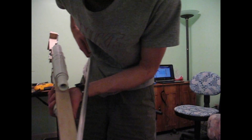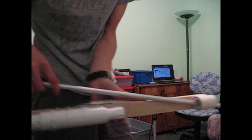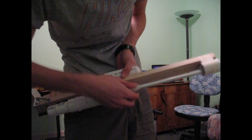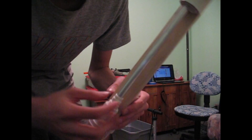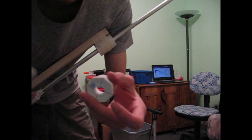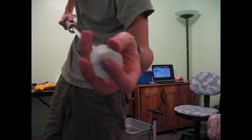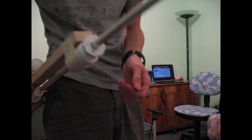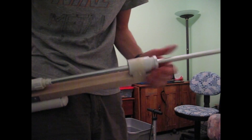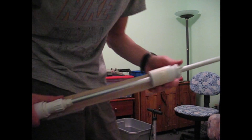I'm going to have an adapter of some sort — this is a one-inch female. The idea of having a large opening here is you can stick a barrel in diagonally, pull it all the way, and then screw it into this adapter. The reason I want this is so that I can have different size barrels, either smaller or larger, up to one half of an inch. Then you take something like this, which is a male end cap — a threaded end cap with a hole. The barrel slides right in there, and if you thread this onto the female coupler, that should keep the barrel somewhat centered. Not perfect, but definitely more stable than not having that.